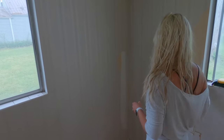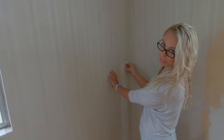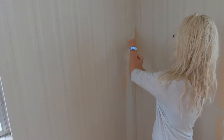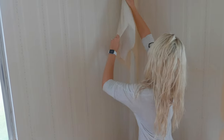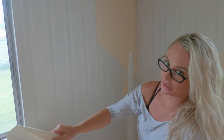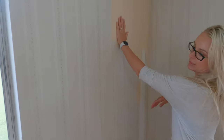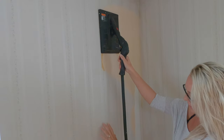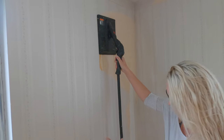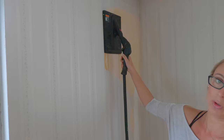When I'm prepping wallpaper, I'm going to start with any areas like this that I can actually remove first, and I'm going to peel back as much as I can. For this area, I won't need to use the scorer, so I'll just be able to steam it. See how this drips? The first one will always drip, and that's why you need to place something on the floor below, because the steam will build.